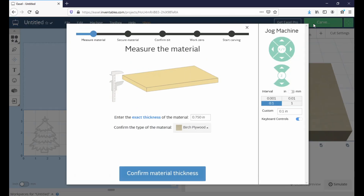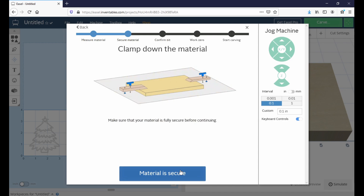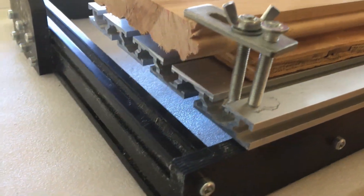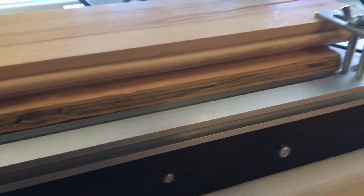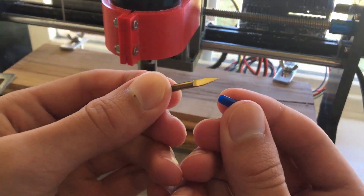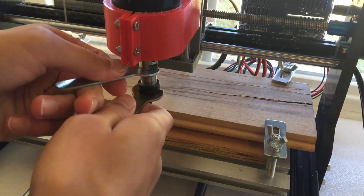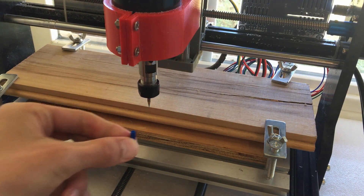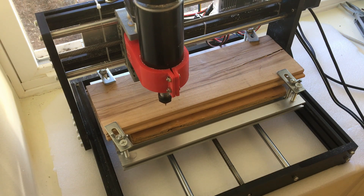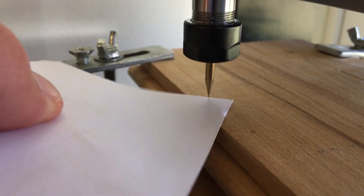When you hit carve, the software will take you through an intuitive step-by-step guide to starting your carving. First, we clamp down the material we want to cut or engrave to the bed of our CNC. We will also add a piece of wood called a spoil board under our work material so that we can cut all the way through the work in a later CNC operation. Second, you will need to insert a desired tool into the collet of the CNC and tighten it — in our case, this will be a vbit. And last, the zero point of the CNC needs to be set. The zero point is the place where the carving will start, at the bottom left of the work material. This is an important setting to get right, because if it isn't set correctly, the carving will go shallower or deeper into the wood than desired.